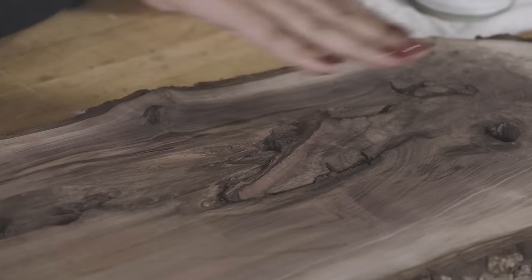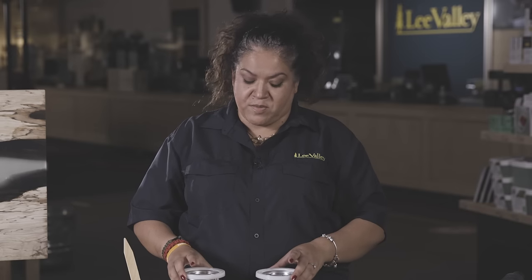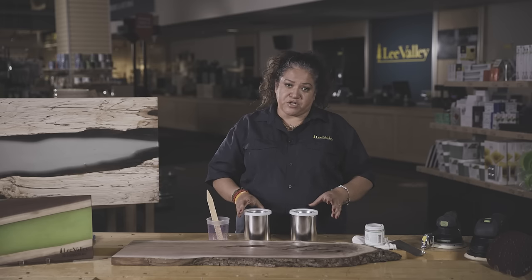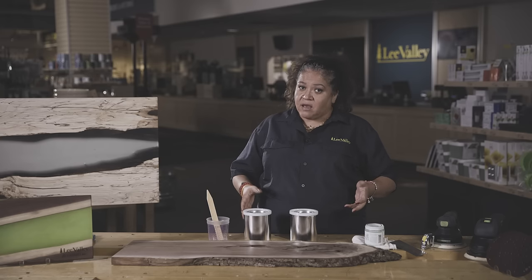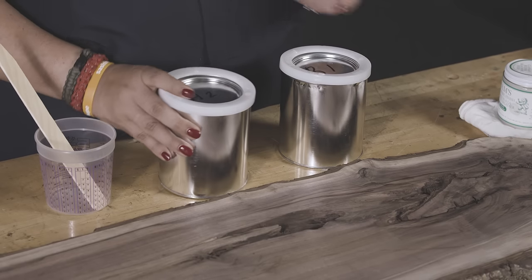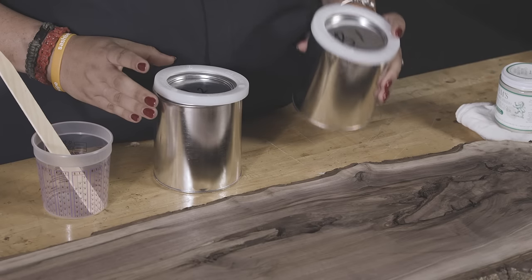For this pour I'm going to show you this one void — you will need to repeat those steps for the other voids and mix accordingly. Now that we've measured the volume, we need to transfer that into our measurements for the epoxy. For this project we've calculated we need about 150 milliliters of epoxy. This particular epoxy has a two-to-one ratio, from our friends at Concept 13. Part A is two parts and Part B is one part, which translates to 100 milliliters of Part A and 50 milliliters of Part B.